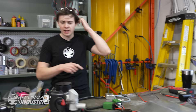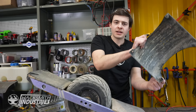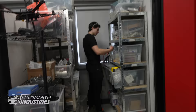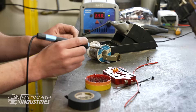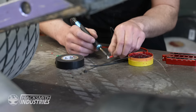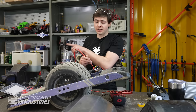We need to figure out how to connect to the Onewheel's battery and what voltages this thing wants. We know the output is about 48 volts. We've modded Onewheels quite a bit — we actually have a video on the channel where we made a Onewheel charge from an electric vehicle charging station. Let's grab some wire, connectors, and wire harness tape. I'd like to solder a connector onto this end. I should be able to measure the voltage of our Onewheel right on here — 56.33 volts, which should be about a full Onewheel, so it goes from 48 to about 55 volts for it to be happy.